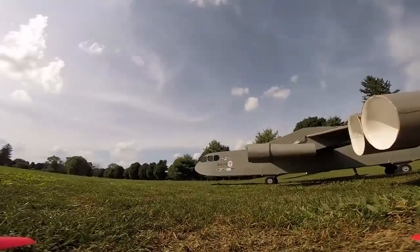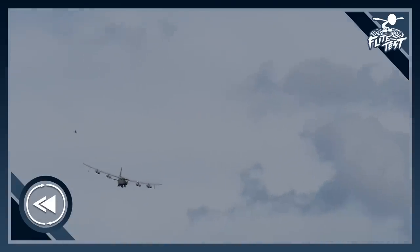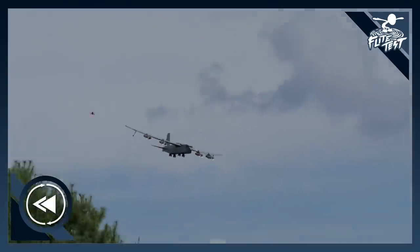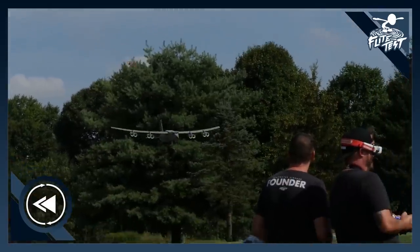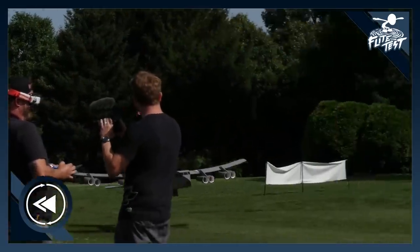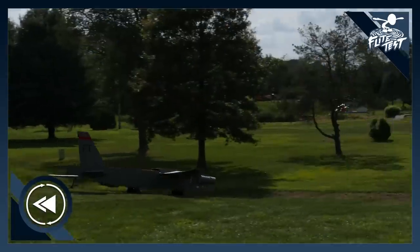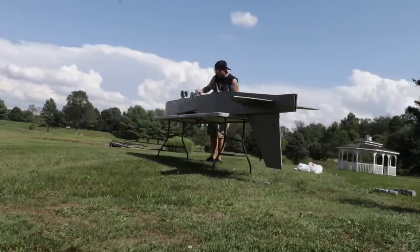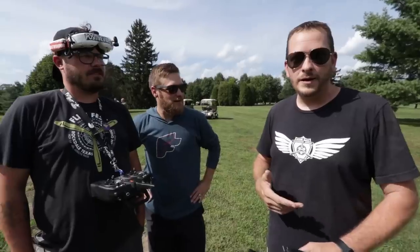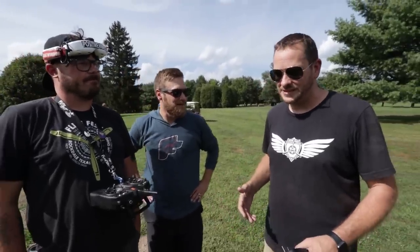My god, that might have been the sketchiest flight. I didn't think it was gonna be sketchy at all. I figured the wing was gonna fold. Yeah. You came around the corner and it was like this, instead of like this. In the air, it was just like a big bird, just flapping. I don't know if the ESCs weren't calibrated or not, but honestly I think what it was is we painted this in the hot sun, and during that time, all the fixes we made the day before came undone. Yep. So we had to basically do some field hacks, which was basically gaff tape.